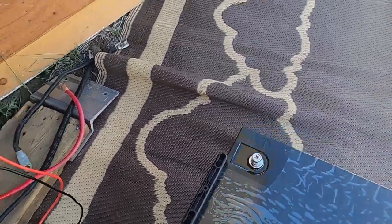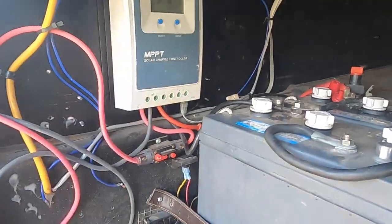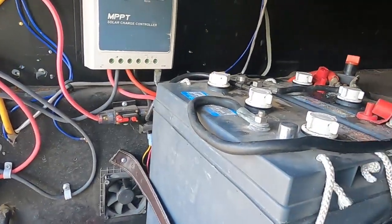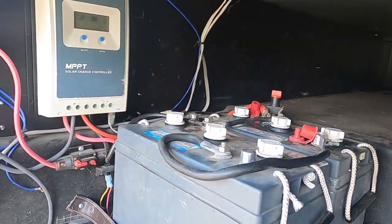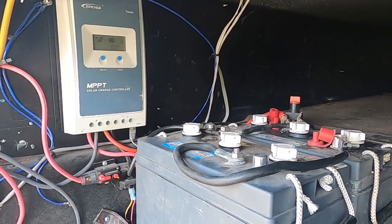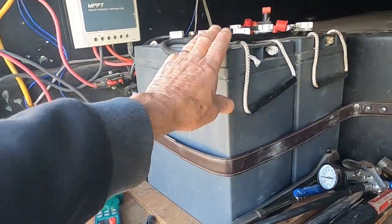I don't expect anything bad to happen. My theory is that my charge controller is going to charge these lead-acid batteries and it's going to charge the lithium battery too. I'm going to leave the setting on lead acid, because what I'm getting is 14.2 volts going into these batteries — maybe just a little bit high for lead acid, but apparently it's been working because they've been in here a couple of years. I do really well with just these batteries.